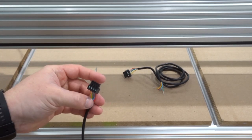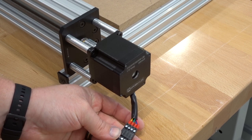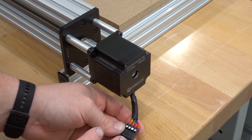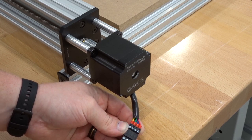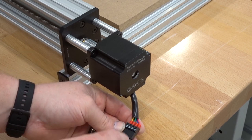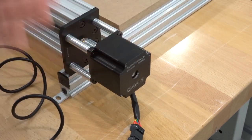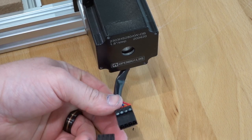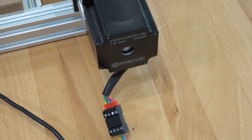Moving to the back of the machine, tie in one of the male connectors. Double check those wire pairs: red and red, blue and blue, green and green, yellow and yellow — I can't stress that enough. If you do something wrong in the wiring portion, you're going to have all kinds of problems to trace back to your controller. Make sure your wires are fully inserted and pins are clamped down. Both three-foot cables are the same, so one goes to each Y motor — don't concern yourself with which motor gets which wire.